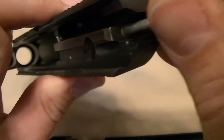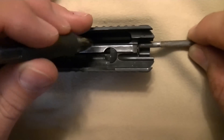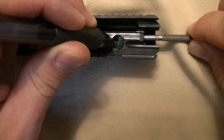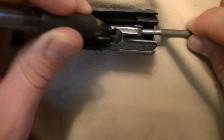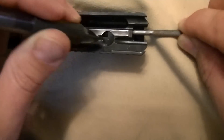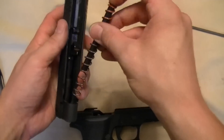Let's look a little more closely at this so you can see the firing pin on the back here. If I try and push that in, it's blocked by something — it doesn't quite go in very far. However, if I'm able to depress the plunger, the safety lock plunger, then the firing pin goes in further. You can see it going in a little bit further, and that's all it takes to get into the chamber and impact the round. So that firing pin won't move forward unless that safety locking plunger is pushed up, and that won't be pushed up unless you pull the trigger to make the safety lever push that up.